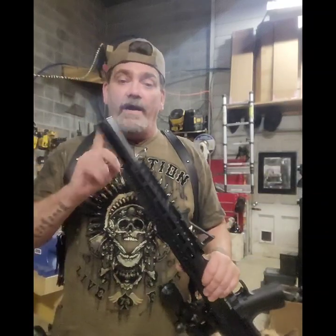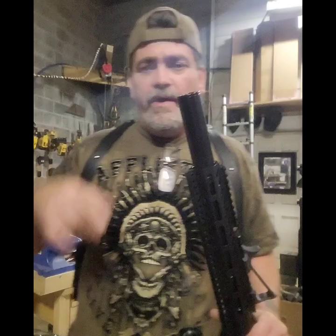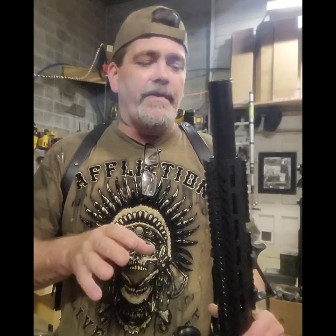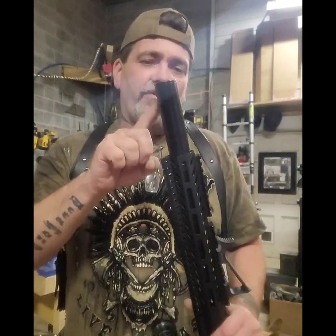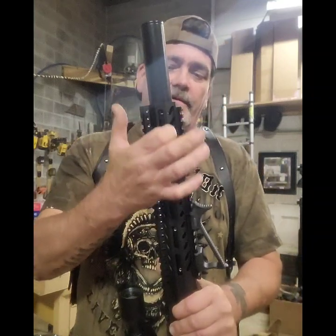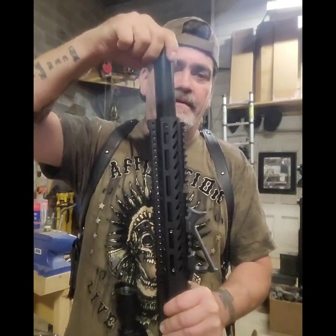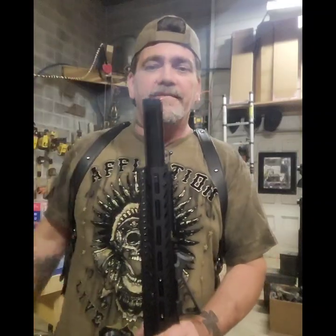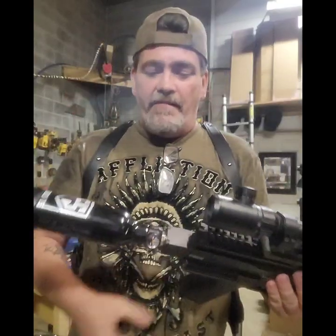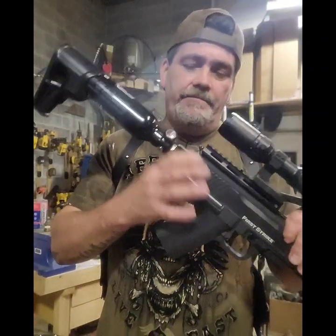What I did was take the M-lock nut on the inside and use the old Dremel round wheel, wound it down to just enough - within a thousandth of an inch, maybe exaggerating a bit - but just enough so my suppressor lands right on top of the nut. The suppressor screws on and seats right on top of that nut into the little groove I made. Look at that - no wobble at all, 16 inch barrel with no wobble. You don't see that often.